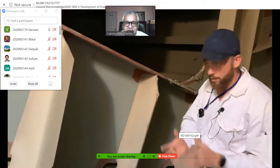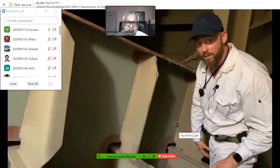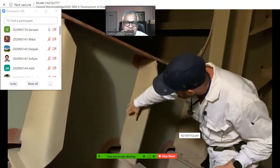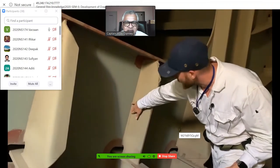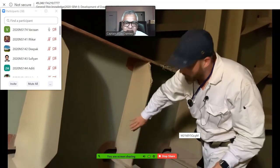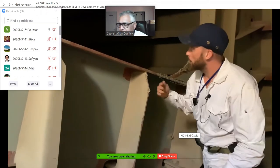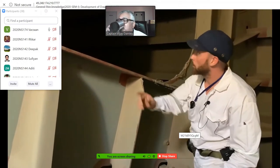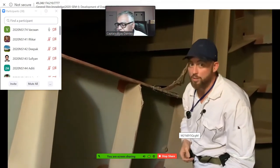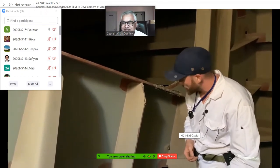Every bulk carrier is a very long and very wide steel vessel. In fact, it's very fragile. The welding seams are all the time experiencing dynamic and static stress. Unfortunately, by means of inspections like we are doing now, it's not possible to inspect all welding seams because there are hundreds of kilometers, I would say, of welding seams, which cannot be surveyed.